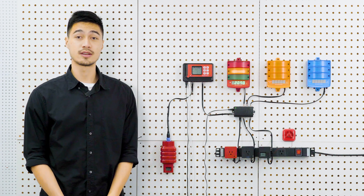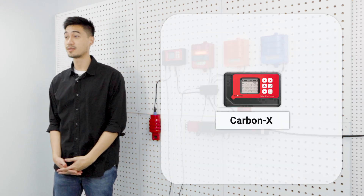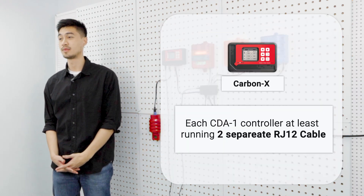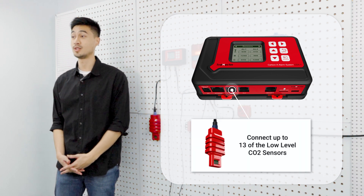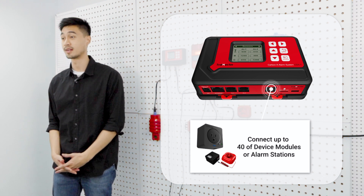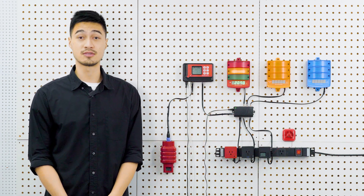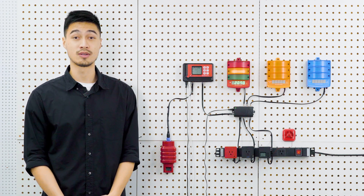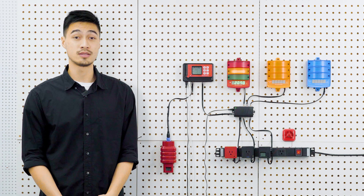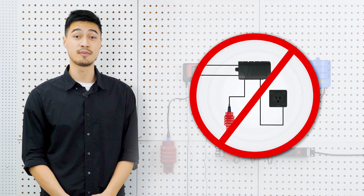Installation of the CarbonX starts with deciding where to locate the CarbonX controller — mounted in a location that is easy to access and away from high levels of humidity and water. From the CarbonX, you'll be running at least two separate RJ12 cables: one cable will connect up to 13 low-level CO2 sensors, and the second will connect up to 40 device modules or alarm stations. You must use one or more SPH1 hubs to connect sensors to the sensor port and device and alarm stations to the device port. Multiple SPH1s can be daisy-chained together using RJ12 cables. Do not mix sensors and device modules on the same SPH1.